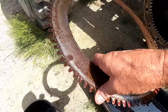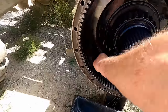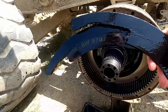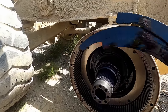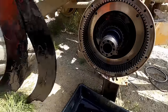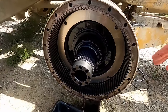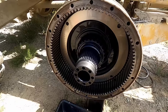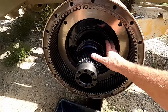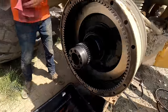This is the last plate on the inside and it's totally delaminated of the rubber. There's a part number — 8-Whiskey-9707 — made in 2006. That's why it's older than the truck: this truck is a 2011, but I bought this whole hub assembly used from a Cat dealer after a major disaster on this wheel. I had a complete failure — lost the planetary. They were working at night in a quarry in Lake Elsinore, and the operator just ran it and ran it until everything was destroyed. I've never seen one that bad. I had to unbolt this whole section and throw everything in the trash — didn't get one spare piece out of it.